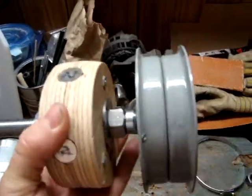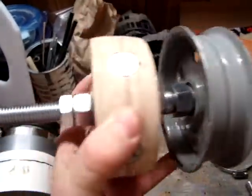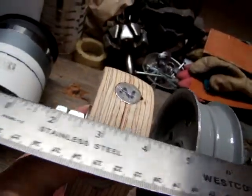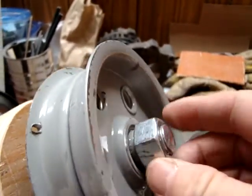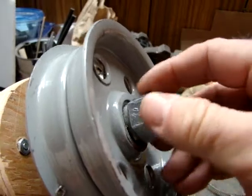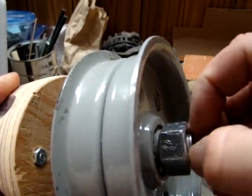A little description of what you might call the drive shaft of this generator. I have cut this threaded shaft to a length of about 8 inches — you buy it longer, but I had to cut it so that it would match this thing. One end is blunted with a hammer so that all the threaded components are added on the other end. This end has a nut which, as it tightens, can't get past the blunted end.